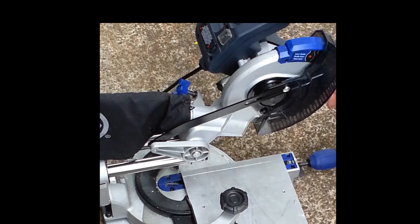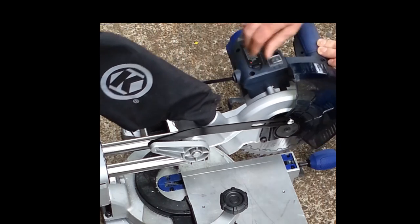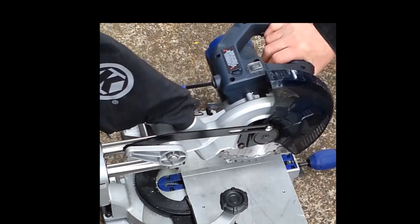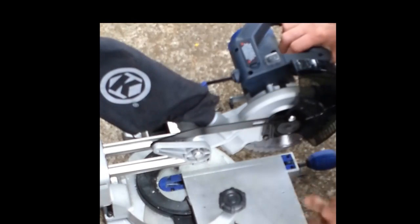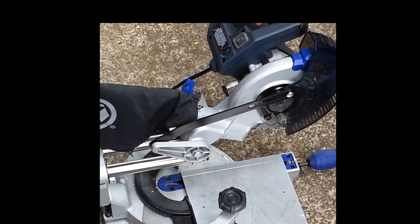First rule of thumb: keep body parts out of the way of the blade — you can break a tooth off or worse. Don't try to stand directly behind it, keep your body out of the line. Obviously, wear eye protection — kind of a no-brainer. I've got the blade set so I can drop it down and it's barely touching the material. I back it out, lower it just to contact, and every time I make a pass I go back out and turn it down a little more. Make absolutely certain your clamp is done up — I could be using another clamp here, but what I'm doing is fine for this demonstration.